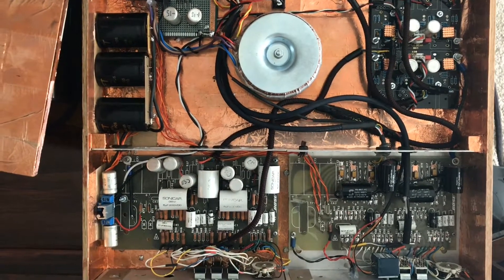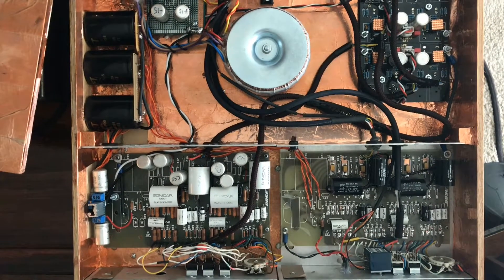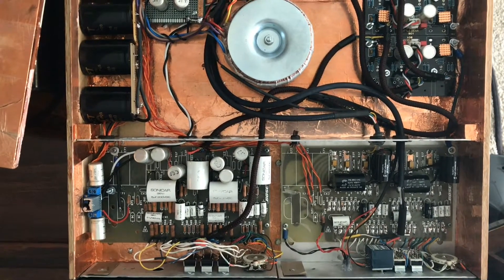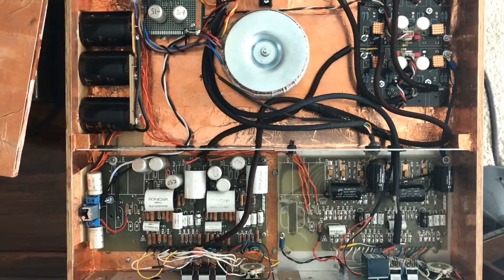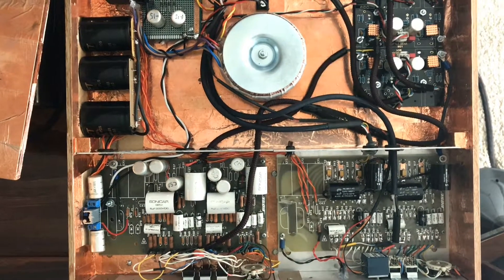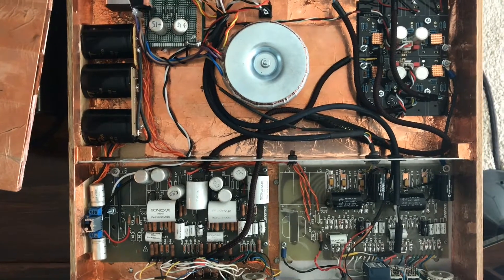And then, as you can see in the picture here, I cut the AC cord out completely, took out the crappy transformer, and just basically tapped off those three big capacitors there for the 20, 18, and 16 volts for the second Bose EQ.